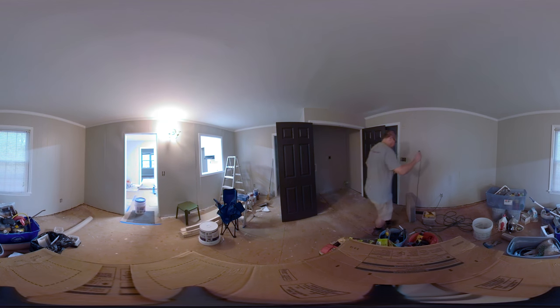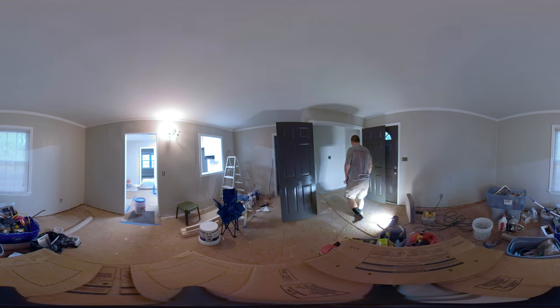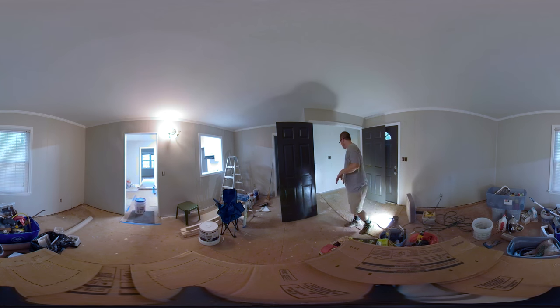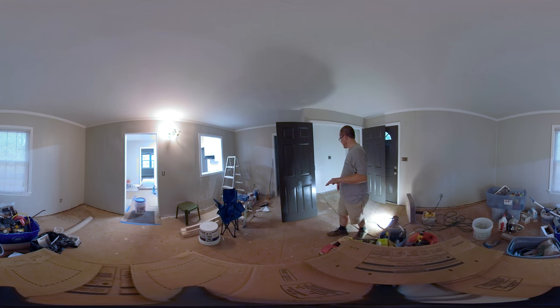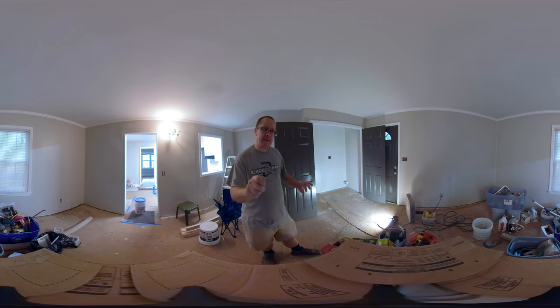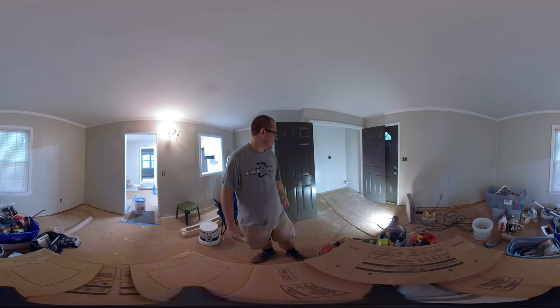I don't have any of the lights installed in the house so we're a little low on lighting, so I'm going to use my work light here. I'm going to clean this out, then put the vinyl in there and trim it up. It's going up a little bit past the edge, and then I'll glue half of it down, lay it down, smooth it out, then glue the other half down. Then I'll come back and trim around the base right at the wall so that the baseboard comes down and covers that, and go into the door just a little bit so the carpet can cover that end.